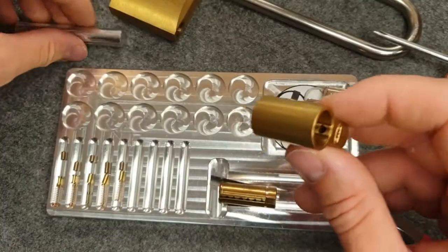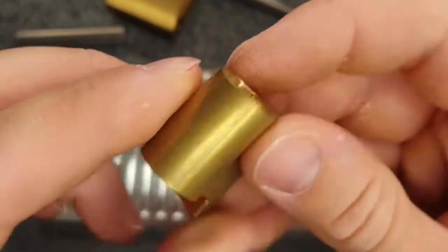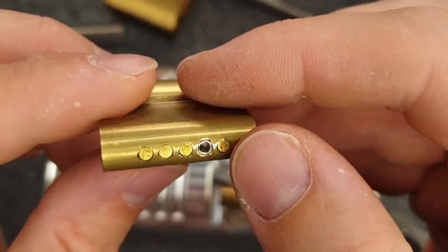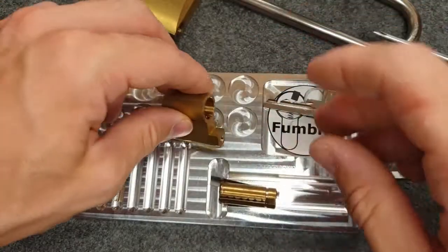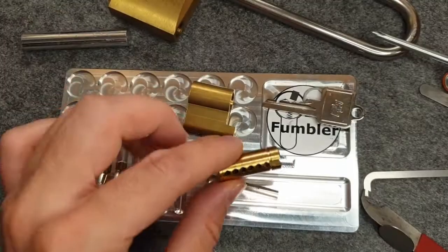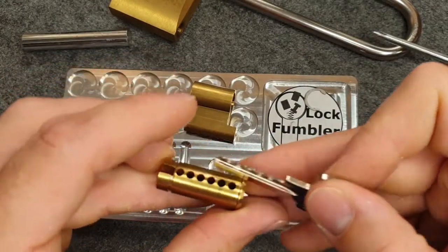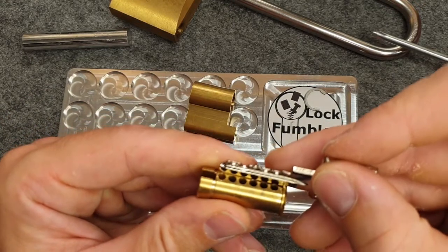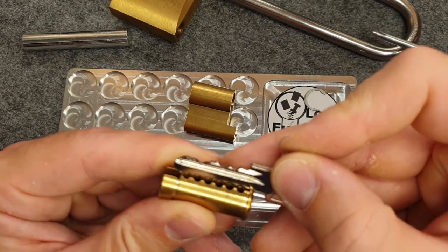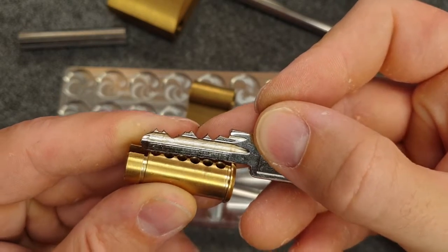Welcome back from fast forward. As you can see it has six holes, and in chamber 3 — check out my last video for what happened there — but everything works, and the core also has the six holes. So I'll go down to the workshop and file the shoulder of one of the keys to shift the bitting from here to here, which should enable us to have six pins. See you back in a moment.